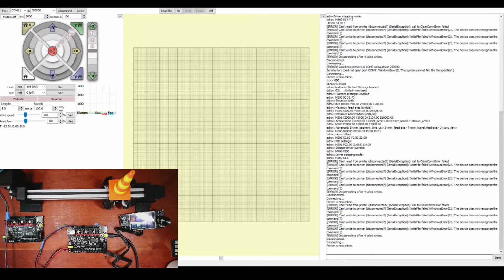when the BL Touch is set up, what you can do is you can send me the config over Discord if you want. I can pull it up and try and do a file compare against a known and an unknown. But the configuration is a little bit interesting. If you're not getting a deploy, it could be the voltage is not right. So on the SKR, you're going to have to look at the actual pinout diagram. So I'll show you that real quick.